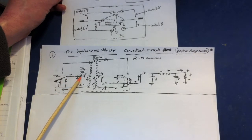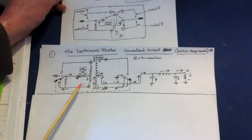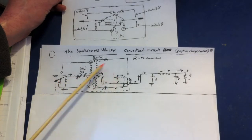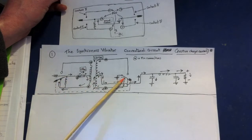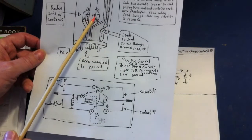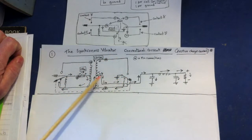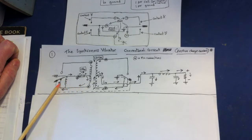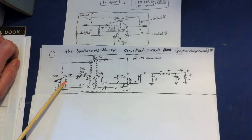Remember that's like one big chain — links of charges all joined together. When you move one side the whole lot moves at the same time. We produce a magnetic field on this coil and it's going to attract that reed switch down. On the secondary side, the reed is drawn over here. When that reed is down, that one is down too because it's the same piece of metal — it's making contacts with two contacts on each side. Now the magnetic field has pulled the reed down, so instead of charge flowing through the original coil it's shorted. You're going to get a very large current — much larger than before — because this coil of wire has an impedance, giving reactance.